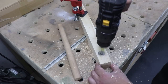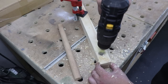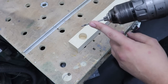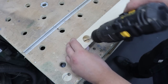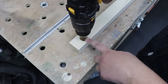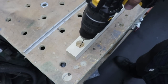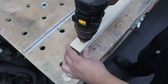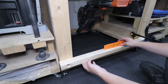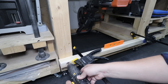I'm not going to go through the whole board — that's why I've marked how deep I need to go with masking tape. After that I'm going to cut this to the right size, glue it in place, and drive a screw from the back to make sure it stays in place. With a four millimeter drill bit I'm going to drill a hole through the remaining part of the board. That gives me two things: one, a pre-drilled hole for a screw to hold the dowel in place from the back, and two, a hole to mark the position of this board onto my workbench so the dowel holes are in the correct places. I'm using a small level to make sure I'm in the right position.